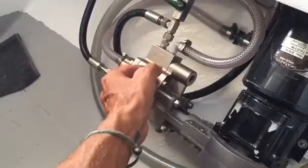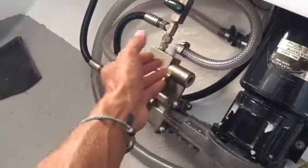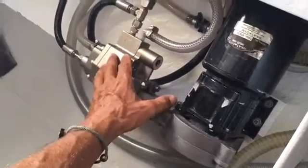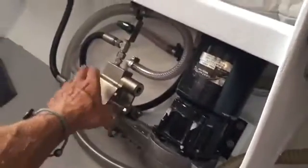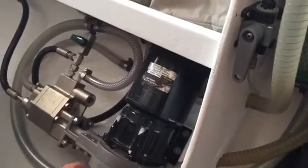The longer it runs, obviously, the better quality of the water. If I run it for a couple of minutes and then test the salinity, it'll be around about 200 to 250 parts per million. You can also get seal kits. We have these reinforced hoses that go to the filter, and then from the filter they go through to the high-pressure pump. That's just to stop the wall collapsing on the hose. This is the bottom of the boat right here, and it's installed as low as we can get it without putting it on the floor. Here's our waterline outside and here's our pre-filter, so everything is just below the waterline and there shouldn't be a lot of suction.